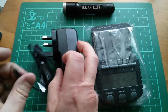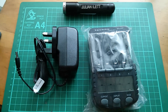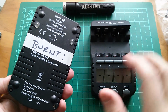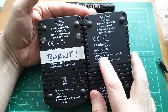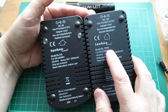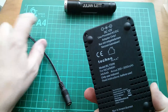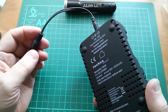They've gone from three volts to 12 volts, which I think is a good idea. It looks almost identical to the previous BL700 I've got - this is the one that I burnt - that's DC three volts, and this one is DC 12 volts. They have a slightly different part number: this is a BL700N, whereas the burnt one is just a BL700. So the N must mean the 12 volt version. The manual probably says only use with the supplied power adapter - I'm not going to do that. I'm going to give it 13.5 volts because that's what my solar power system is at at the moment.